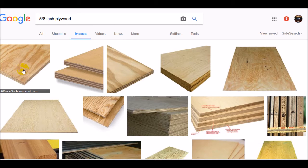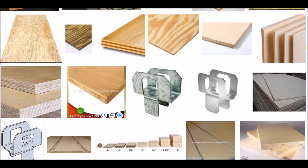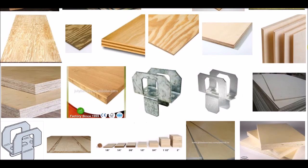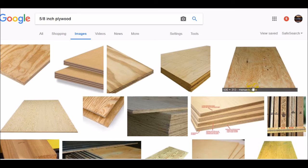What you're going to need is a piece of plywood. The quality of plywood that you use is up to you — it all depends on how much you want to spend. I think I bought a $20 piece of plywood, but there are more finished pieces that look a lot nicer. If you're going to cover it up anyway, I wouldn't worry about it. I used 5/8 inch because I'm about a 200-pound guy, and so I didn't want to have to worry about adding supports all through the underside of this. This is simply four supports — I'm going to show you how to cut those and how to install this.